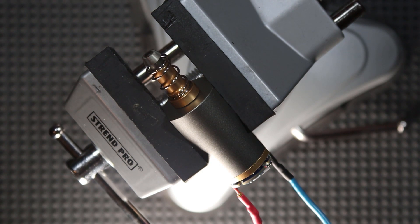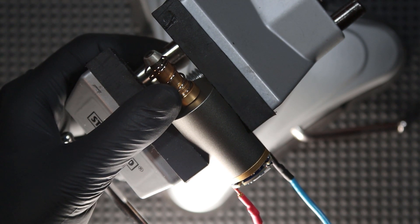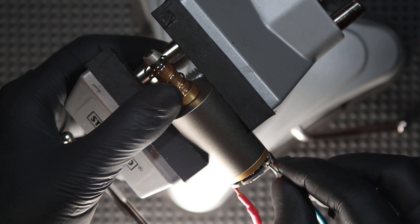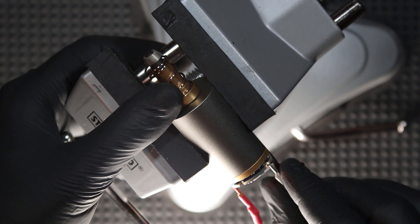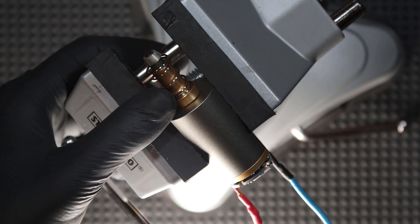Before we do a little comparative testing, let's return to the speed control. If the firing rate on the motor will be too high for us, then by turning the regulator we can smoothly reduce it up to 50%. It's worth remembering, because in the case of operation with a MOSFET, the regulation from the MOSFET circuit level may not work properly.